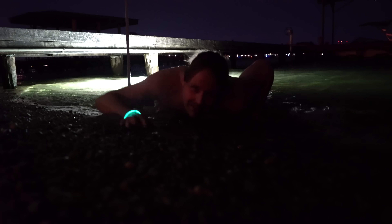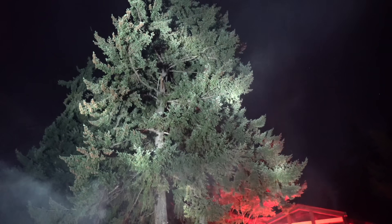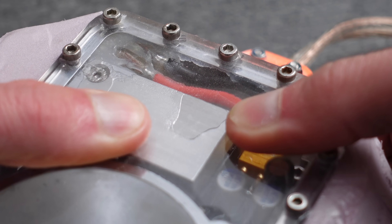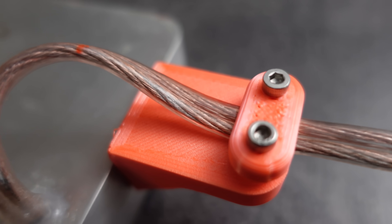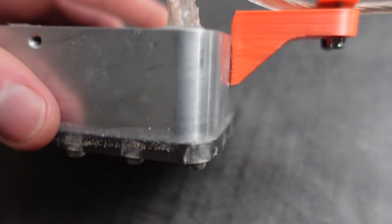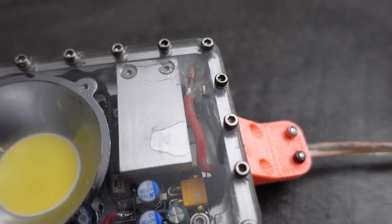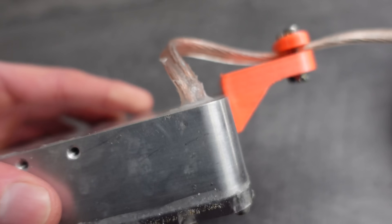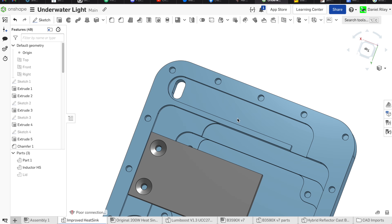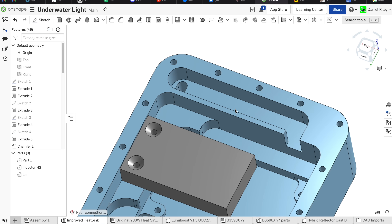The light shining in the trees looked really cool. The light itself, on the other hand, did not perform that well — it never turned off due to water ingress, but after the party there were definitely a few drops in the enclosure. I'm pretty sure this is because I didn't take the rubber sheath off the wire at the area I potted in epoxy, so water was probably just squishing in around that. I later learned that for proper waterproofing, you really need to strip back the sheath and tin the wire strands for the section that gets potted — that way, no water can squeeze through. I later redesigned the enclosure to have a much longer epoxy trough, but I have not gotten around to testing out this newer version yet.